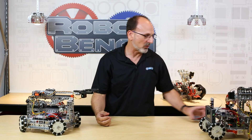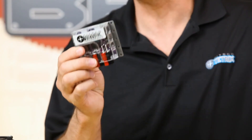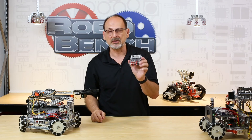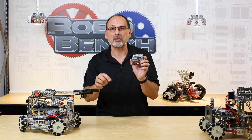One cool use that might not be obvious: because the DC motor boxes have a 12-volt output, they can be used to control lights. You can program lights to come on or off, dim, or brighten, just by using this motor controller and outputting to a 12-volt light. So there are ways to use these beyond the obvious motors and servos.